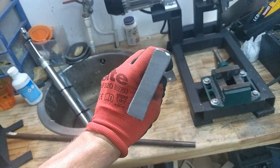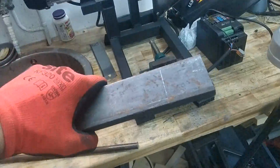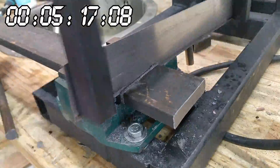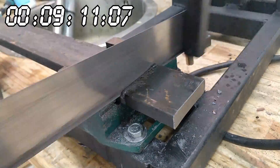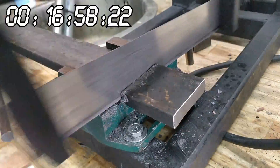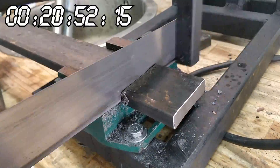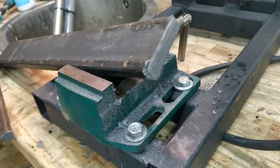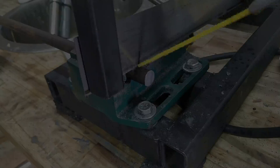Now let's really push this thing to the limit — a piece of 52x15mm steel bar. I had to speed up the footage quite a bit here. I clamped this one down horizontally. Although it'll take much longer to cut than if I had clamped it vertically, the cut should end up a lot more square. This one took a whopping 27 minutes, but the cut ended up being perfectly square.